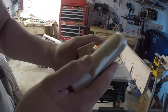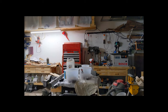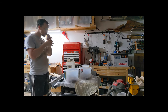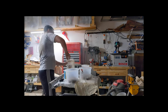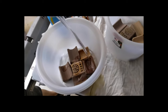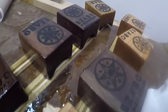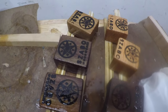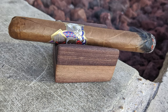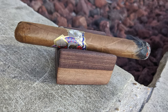The sticks weren't a total waste though. At the very end, I was able to use the stick with 240 grit on it to smooth out some of the rough edges. My favorite part of any project is the finish — this one felt a little special, so I pulled out a cigar while doing the finish. I was using Howard's cutting board oil over the top. Once that set and dried a bit, I poured the excess back into the bottle, then used Howard's cutting board wax over the top.